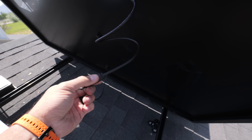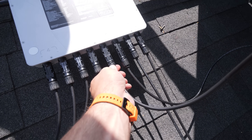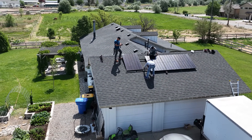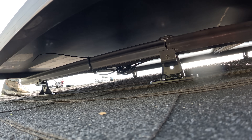This is the only panel that doesn't need leads because it sits so close to the inverter. If the first panel is lined up square, chances are the rest of the panels will be too — if it looks straight, it is straight. One of the most important rules of solar panels is that none of the wires can ever touch the roof, so we use zip ties to keep those wires attached to the rails.